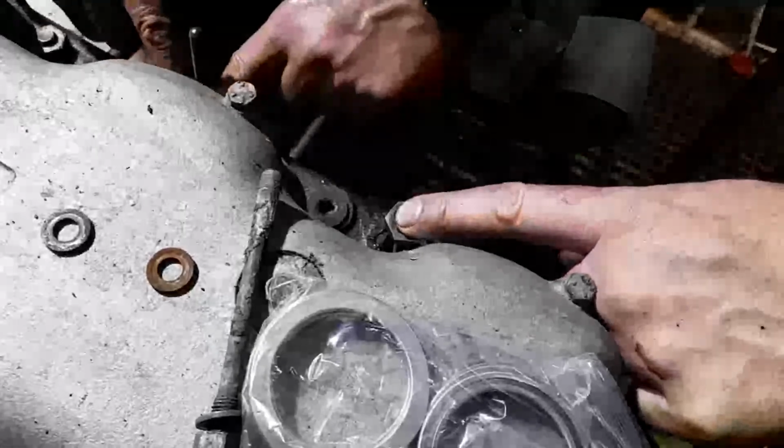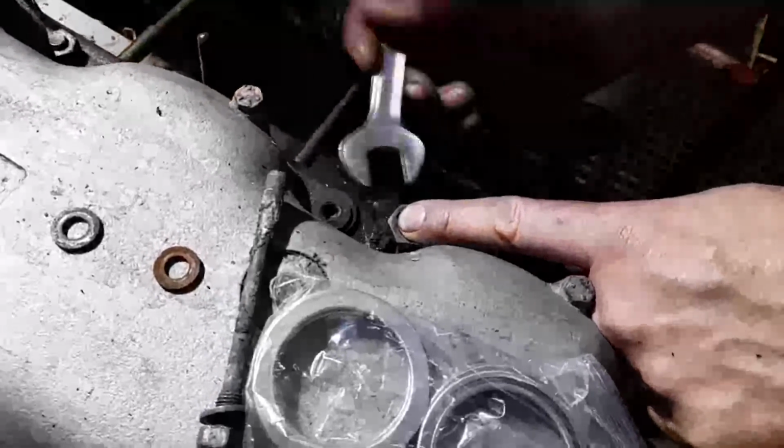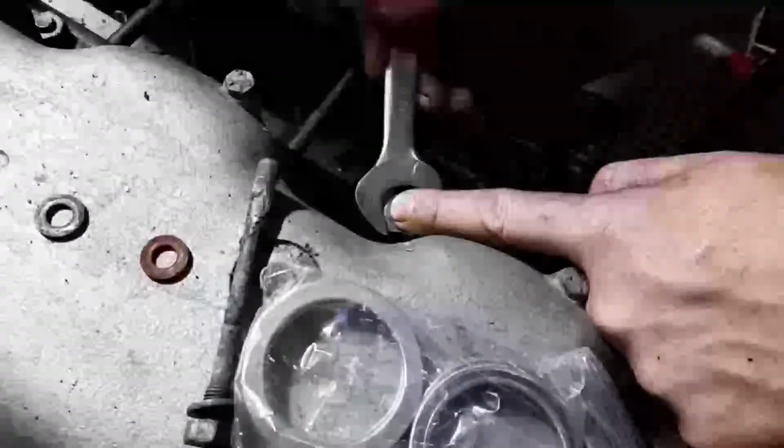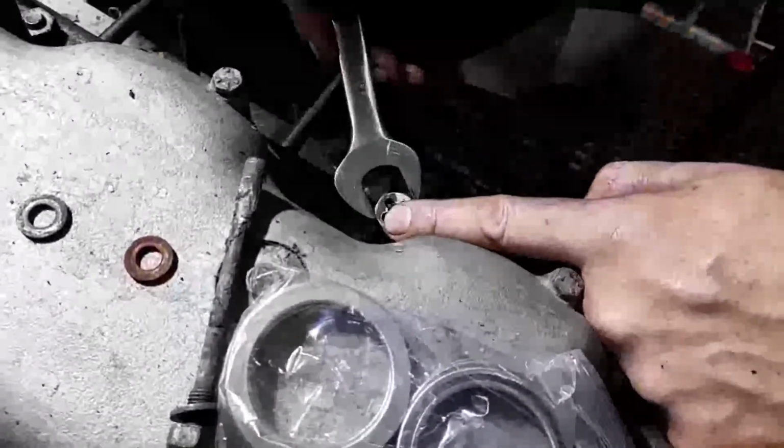It works very well, and then we're able to split the whole top rail open with a cold chisel. Here you can see the cold chisel at work. We simply split the alloy down the side of the stud, and it breaks away in quite neat pieces. It means that the studs can then be extracted and reused if need be. If we're reusing the old studs, it's a good idea to run a 5/16 BSF die nut down them, just to clean up the threads and take out any dirt and damage.